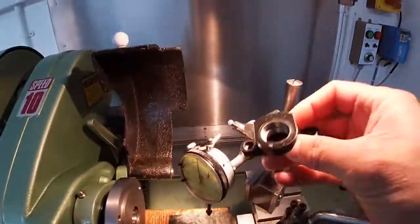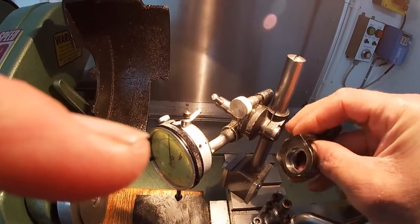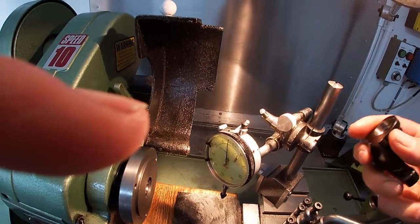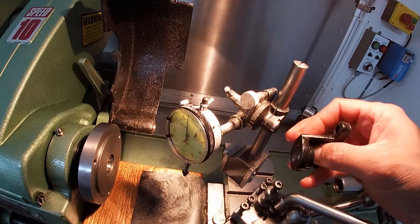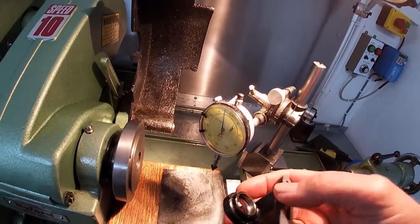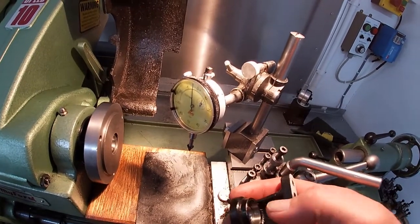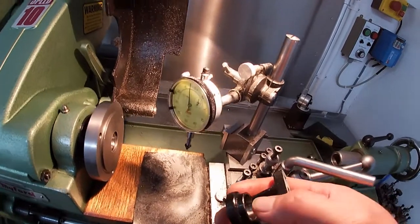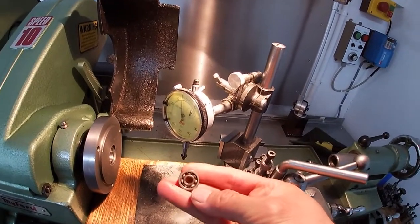Now you can see the insert there. Inside you can actually see the point where I've pinned it — I put the bearing in and actually pin it here and here. Even though it is a press fit, I always like the confidence of having some metal in the way. This is silver steel I've used. The bush is the same front to back. You can see I've got a three-quarter inch — 750 thou — bearing pressed in there, and it's 5.55 millimetres thickness, which is an imperial size.